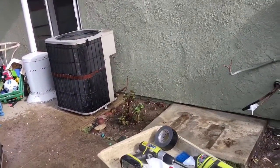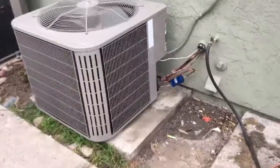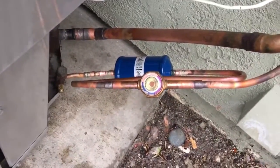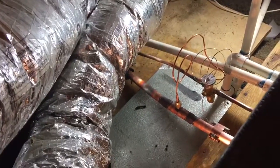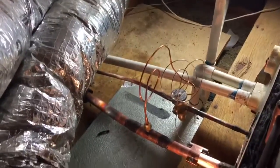Unit's pulled loose and put aside, waiting for the other one to go in. Final picture — well done. Over here: sight glass, dryer. Going over the back side of this unit. That's the installation of the equalizer and the expansion valve — a 4-ton Danfoss expansion valve.